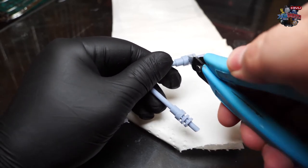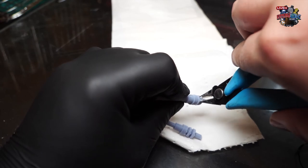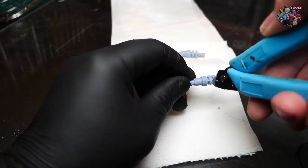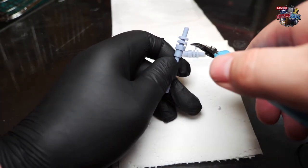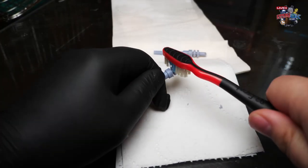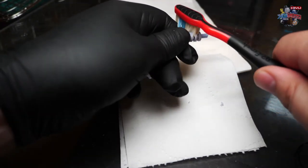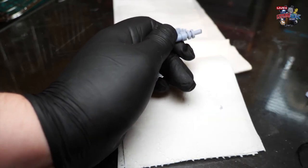After this I like to do a bit of cleanup work — either a little sandpaper, or in this case all I had to do was remove some of the detritus in the middle. Just get an old toothbrush and brush it through. You're essentially trying to clear any nubs left from the support material, or any powderised resin — the resin does powder a bit when you snip at it. Clear it off ready for curing, because anything left on there before you cure will prevent the UV rays from fully curing the part.